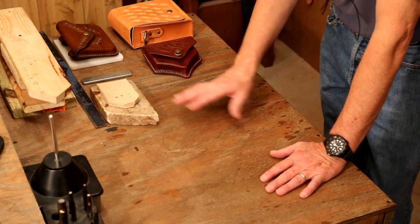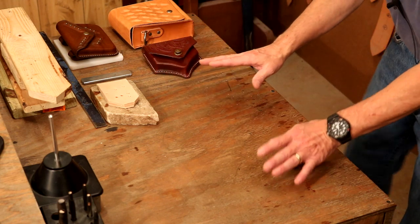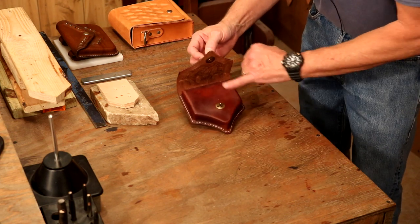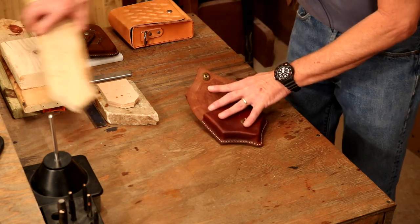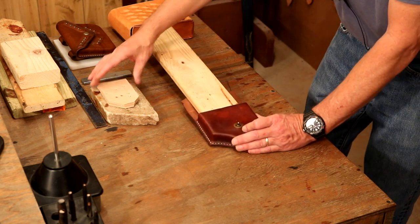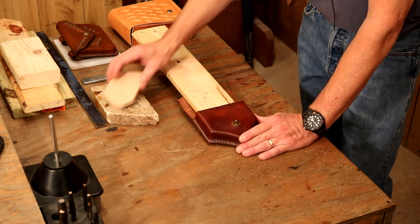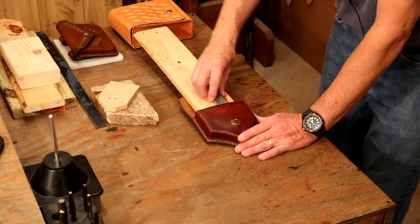I've always heard the saying that one person's pleasure is another person's trash. A leather shop seems to fit on both sides of that, because what we've got now is just a bit of odds and ends. Perfect example: with this pouch, I've got an odd shape — I'm wet forming. So the first time I make this, I'm not really sure where my closure is going to land. So what I've got is a one-by-four and I've just cut an end on that — that fits right in there. And this is just three pieces of leather scrap glued together, so that'll slide down in there. I can punch my hole, pull that out, drop my anvil down in there, and I can set a snap or whatever I need to set.